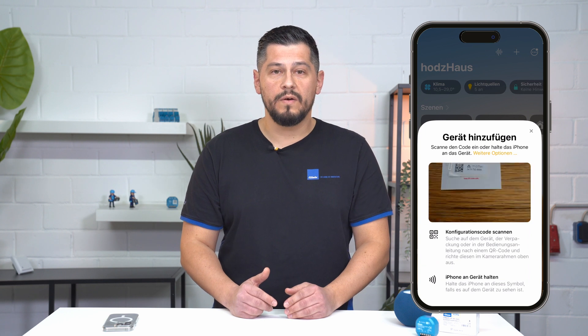Let's get a little more practical. After you power the dimmer, you hear a beep for confirmation, and then the dimmer is ready to learn. Now we start the HomeKit app. Here you can see my living room — there is already a lot of lighting going on, but I still need this dimmer, so I teach it. Via the small plus sign in the top right corner, I click and a small menu opens. I can add a few things at this point, and I decide for a new device. The camera now opens and I can scan the QR code I mentioned earlier. It immediately finds the dimmer, and I only define the room in which I want to store it and give the dimmer a name.